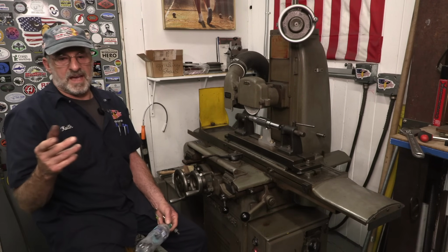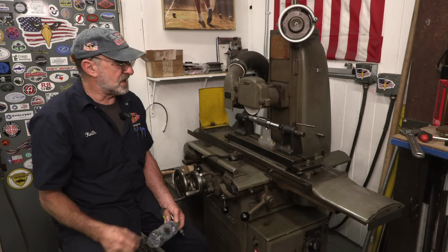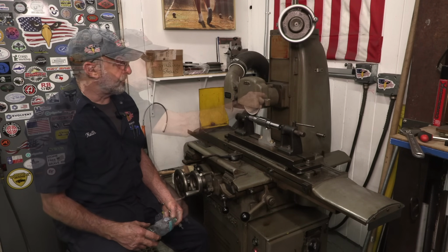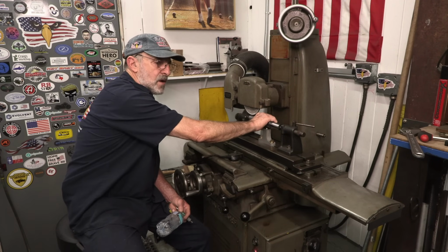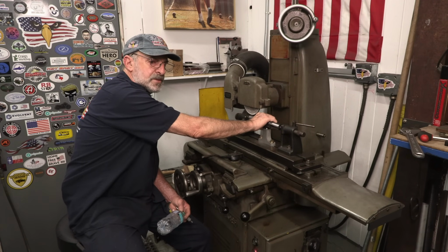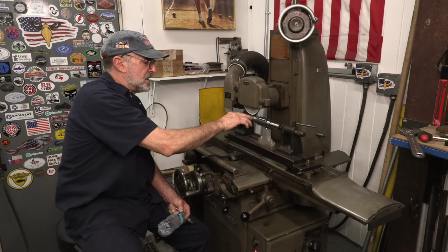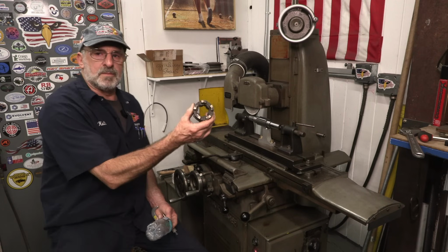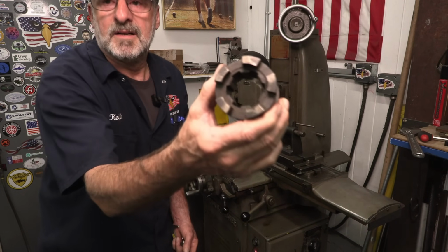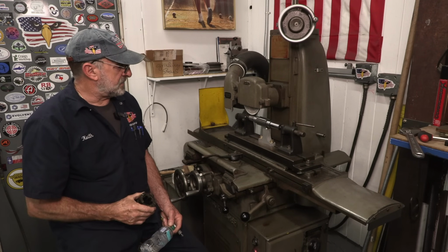Okay, I have another cool mister that I've been putting together, because I like the one that's on the lathe that we used there. And we're going to see if we can come in here with the cool mister, because I want this to be ground at a cool temperature. And I want to keep the temperature down on it, because I'm going to grind it and I want to measure it in real temperature and also have it real close, because we're going to be making sure or checking the fit with the female here.